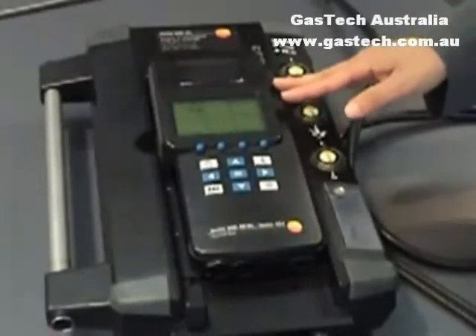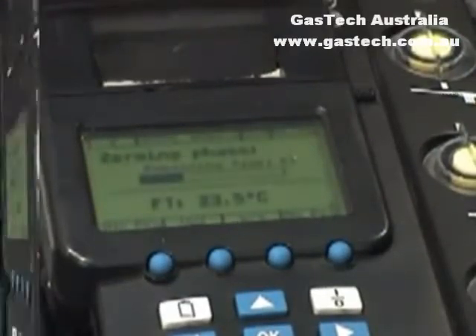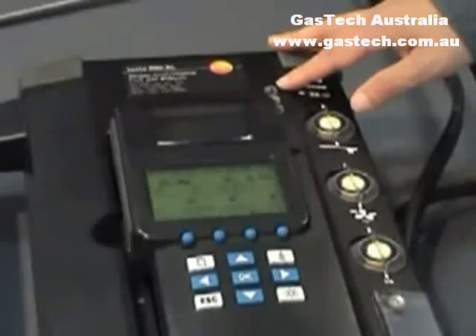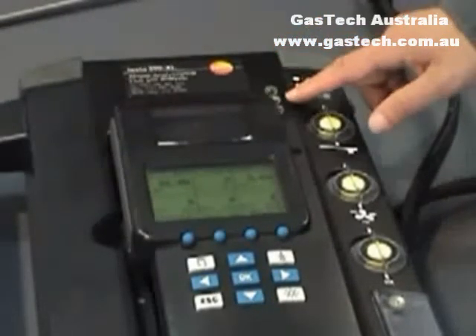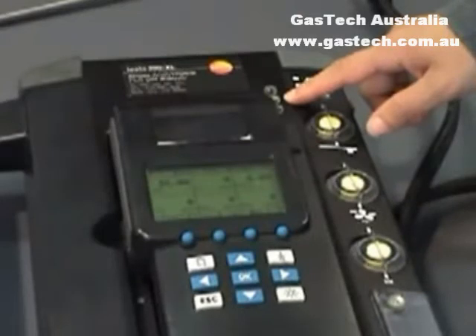The initiation screen is displayed and the data bus is scanned for connected system components. It's undergoing zeroing at the moment. For the top LED light: if it's green and steady it's mains operation; if it's green and flashing the rechargeable battery is fully charged; if it's red and flashing the rechargeable battery is low; and if it's off the instrument is switched off and recharging. For LED light 2: if it's green and steady it means it's in measurement mode; if it's green and flashing it means it's doing fresh air zeroing; and if it's red and flashing there's an error and you'd have to go through diagnostics.